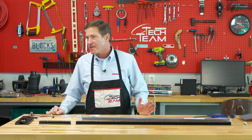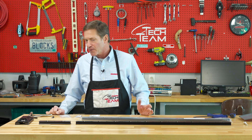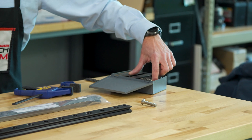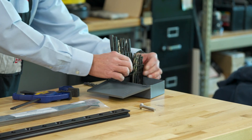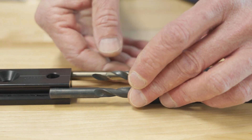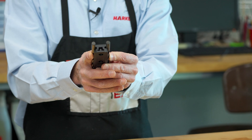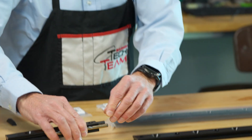A simple workaround which achieves the same ultimate goal is to find a couple of dowels — or every boat has a proper drill index — a couple of drill bits which are the same diameter as the ball bearings in the track. These will be placed on either side of the track at the splice to align them, which is all we're doing with the splice link anyway.